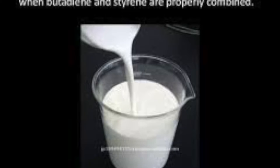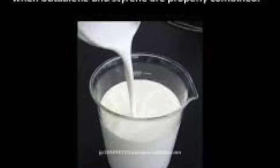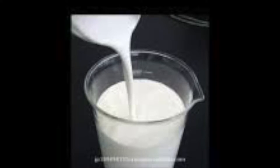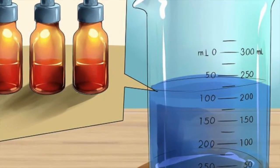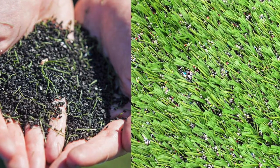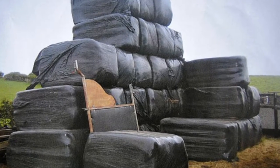Polybutadiene is a rubber used to make tires. They then add another catalyst and that makes synthetic rubber in liquid form. You then put a solvent in and the liquid is boiled until the solvent is boiled out. This leaves little pellets of rubber in solid form, and then they crush it into a big bale of rubber that can go into anything from car tires to tennis balls.